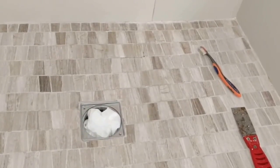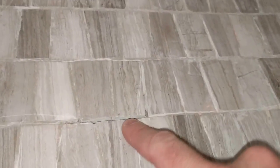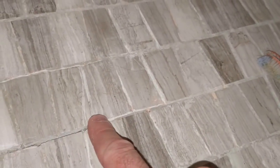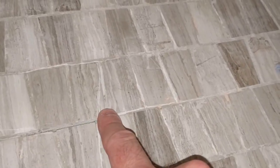Just not to show the drain on video — it's a little nasty. But what you'll see here is that over time, in a shower, some of the grout will start to come out of the shower floor in different areas. We'll need to come in here and clean this out, get the debris out, and re-grout.